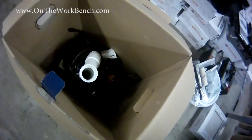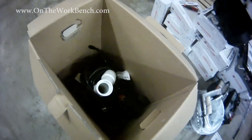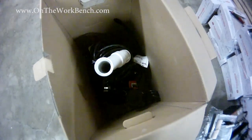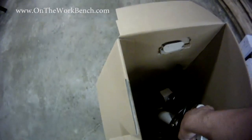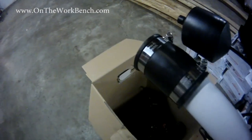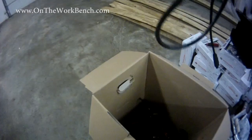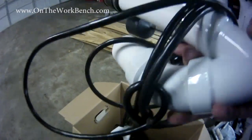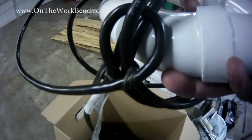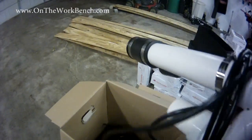One of the things about this system that I like is that a lot of the parts are supposed to have come pre-assembled in the box, or at least all the parts are here. It looks like they're mostly pre-assembled at the bottom, but lifting up on the assembly, I can tell it's actually not completely pre-assembled. There's a rubber union fitting here, a float switch, a plug-in for the battery backup, along with a Y — this is an inch and a half PVC pipe that you can use for your sump pump drainage.